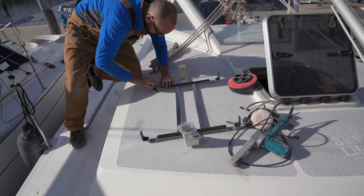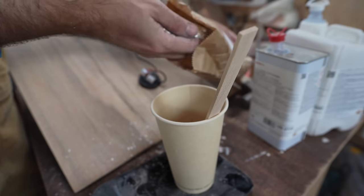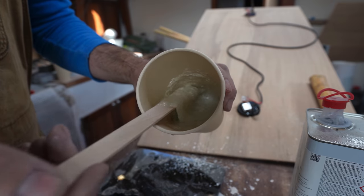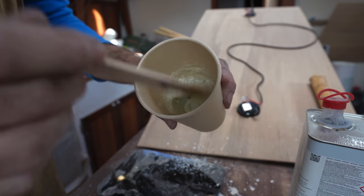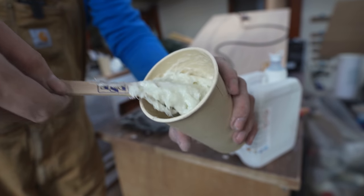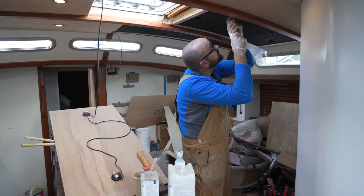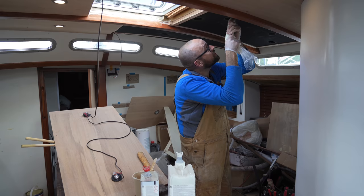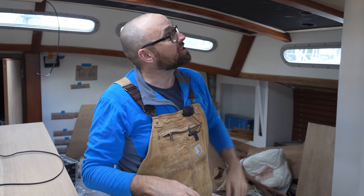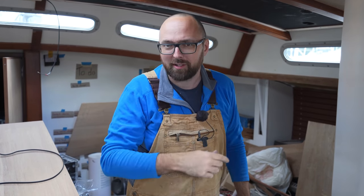To make sure this is not going to start leaking I'm going to sand away a little bit of the KiwiGrip. These are the chopped fiberglass strands I'm adding — it's a lot easier to buy a bag like this than trying to cut it yourself. There's quite a lot of glass in here so now it's just a matter of adding 406 until it's not a droopy mess anymore. I've applied a little bit of tape up on deck just to make absolutely sure I don't end up with a bunch of epoxy stuck up there. After having smoothed over the holes I've got a pretty neat looking surface in there. These should be ready for me to mount the cradle tomorrow — but yeah it's time for me to apply another coat of primer and I'm going to do that off camera.